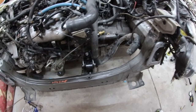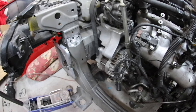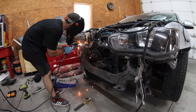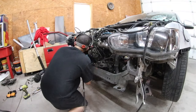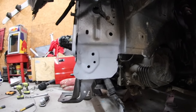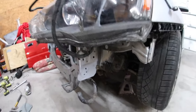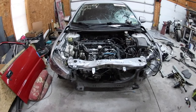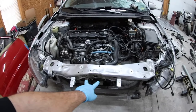I got the new core support mostly in position. I got the center bar — the transmission mount bracket, I'm sure there's a name for it like a mustache bar or something — I'm going to press this in, you can see the holes line up, and I'll get it welded. So I got everything welded up and then went ahead and ground it down a little bit so it doesn't stand out so much, so it kind of looks like factory tack or spot welds. I'm pretty happy with it. It's just primered — I shot primer over the top to keep it from rusting, it'll get some more paint later. I might grind it down a little more and then it'll probably get shot silver. I got the car on the ground and went ahead and put the upper core support crossbar on for now just to hold everything straight.